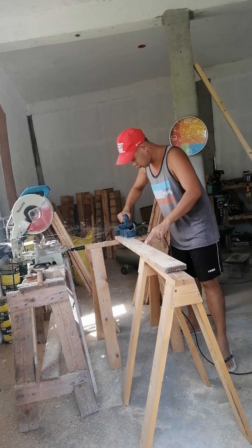There you go. You don't need to go very deep, because with an electric hand planer, if you get good at it, you can make it really flat. But I prefer to finish it on the thicknesser planer to get the same thickness, especially for a specific project where you want all your wood uniform. Just remove the first surface and you save your thicknesser blade — that's a thousand to two thousand pesos saved every time. That's it.